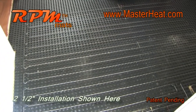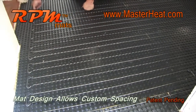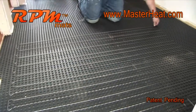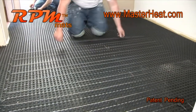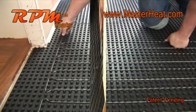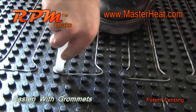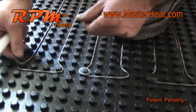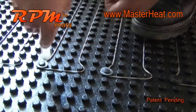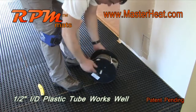The stud diameter is half inch and one inch on center. The stud spacing allows for wire installation at two inches, two and a half inches as shown here, three inches, or any custom configuration. The heat wire is unspooled directly into the RPM mats below the installer's feet. The wire goes in really fast without metal tabs to fasten. Place rubber grommets onto the studs to keep the wire from lifting out of the RPM mats, and use a tool such as the plastic spindle from the heat wire spool to push the grommets down quickly.